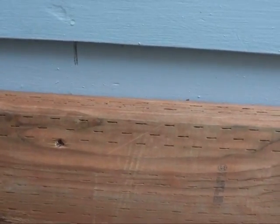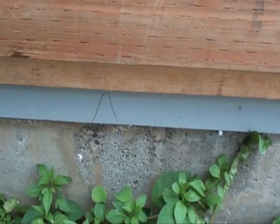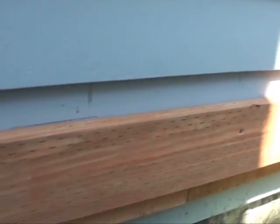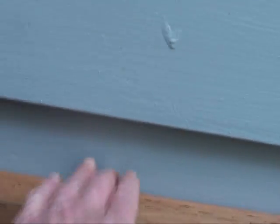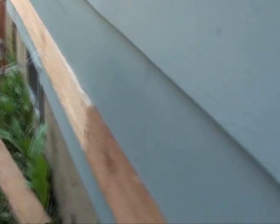And then the other side there, we got one of our 2x6s attached here, just with a few screws right now. I'm going to go back and hit them again. I've got all my wall studs marked. I think you can see that pencil mark there, where I'm going to run my screws. And then my deck boards will be just sitting right on top of this on the edge. Going to do the same thing to the other side over here.